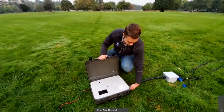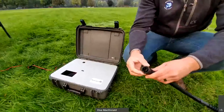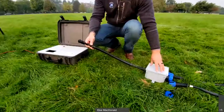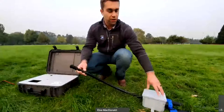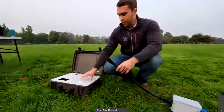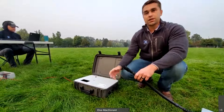Now let's get into the connection for the J-Box. The J-Box is the junction point between the antenna and the reader itself. It comes with the exciter cable, which has a back shell connector that plugs into the side of the enclosure. This J-Box is weatherproof but not waterproof — it will be good for snow and rain conditions, but it cannot be submerged. If you need a submersible product for in-stream aquatic applications, we have the LITS cord antenna, which is completely submersible — keep an eye out because we might have a webinar on that in the near future.